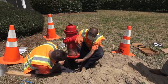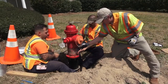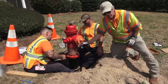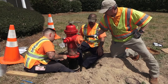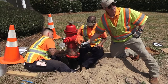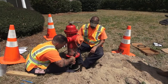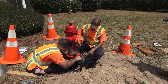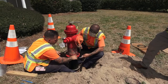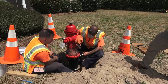For GIS and maintenance purposes, notice the tag with a number on the pumper nozzle. When doing hydrant maintenance to ensure the hydrant opens, closes, and is properly lubricated, note the hydrant number, address, and location on the hydrant card and fill out the maintenance report. In today's case, we put a 12-inch extension on this fire hydrant, so on the maintenance card we need to note that this 3.5-foot trench fire hydrant now has a 12-inch extension, making it a 4.5-foot trench fire hydrant.